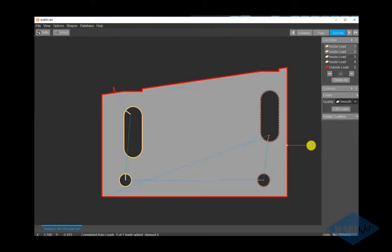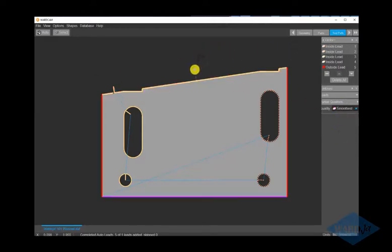And then in a similar fashion, you can do the same thing for a portion of a cut. So with this partial qualities tool here, if I expand this, if the bottom edge of the part wasn't so critical, can choose the fastest speed, click a couple points there, left click to lock that in. And if on the top edge we wanted that to be again slower and smoother, can choose different quality for that area and then left click lock that in there.